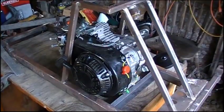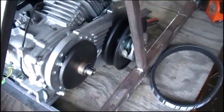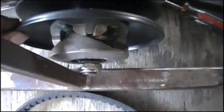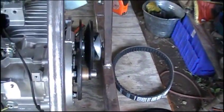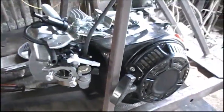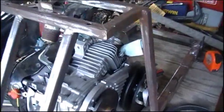We're going to get the racing lawnmower frame back up on top of the desk here and try to mount this motor. So we have the motor mounted within the confines of the racing lawnmower chassis. I had to take the driver clutch off because it was too bulky to try to fit into this steering box that I've made here. The problem was right in here checking the clearance for this driven pulley, and we've got just enough to squeak by it looks like. The driver pulley will be perfectly fine because it's out there all by itself. This other side is about as close as you could go and still be able to operate. It looks like to do any work — pull this cover shroud off or anything — you're probably going to have to pull the whole motor right off the tractor. That may even be the same case to change the belt because this thing is packed in such a tiny small little spot.